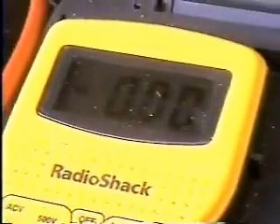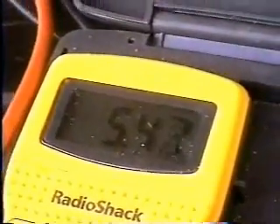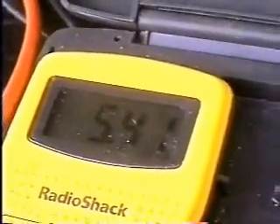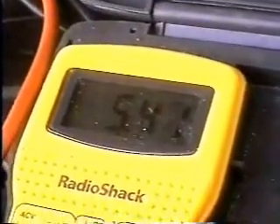Here's the unit here again. A little noisy — it's cold, that's a cold start. Let me boost the throttle to slow it down. Now we'll go back to our voltmeter, which we've got sitting right here at zero volts. We'll take the positive lead and put it down to the canister on the stainless steel jacket. And as you can see, we're running about 5.4 volts, and that's more than enough to do what we have to do. So there you go — a Super Gen Series 9 cold start governed at 5.4 volts. It started up cold with roughly about four or five amps, but when it warms up it'll go up to about eight amps. And it works quite well.